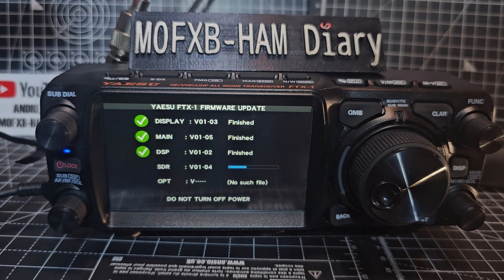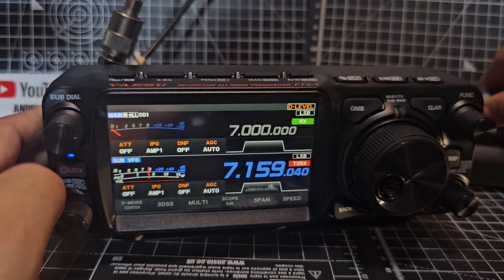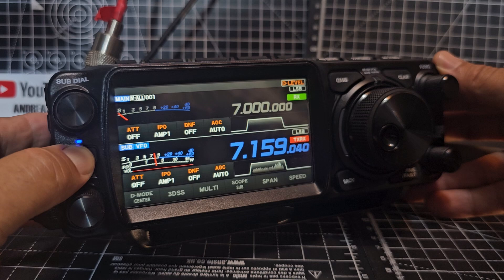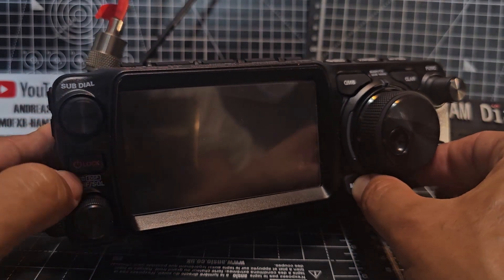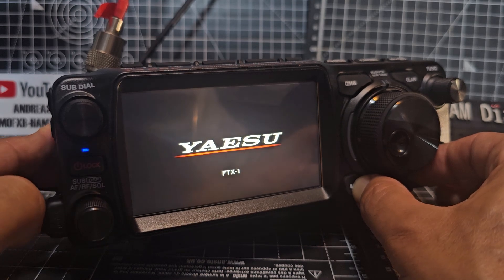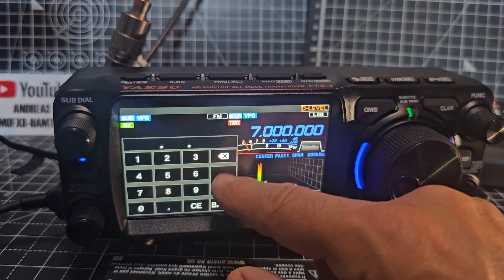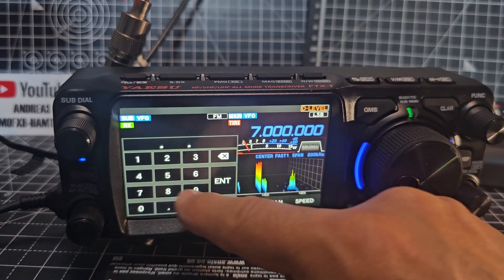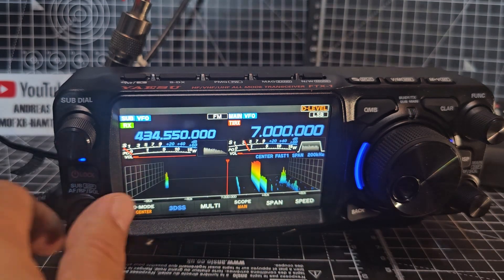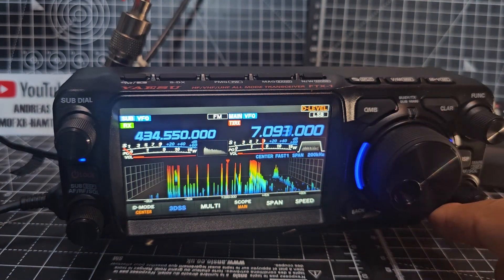One more to go — that's completed nicely. Now we're just going to do the factory reset. Turn it off, push the two bottom buttons, and turn on — keep your fingers on the two bottom buttons under the VFO. Factory reset. Let's see if we get my node in here — Enter. That's my node, and then we'll go up on HF to see if there's anyone about.